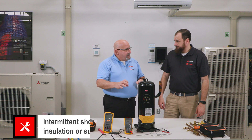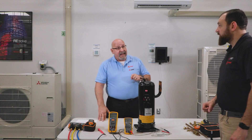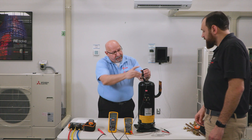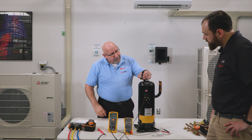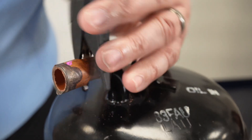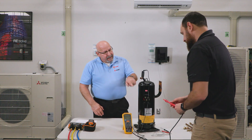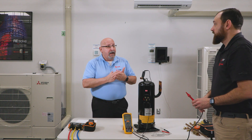So we're going to check the windings now with the Megger. We recommend using the 500-volt scale. You need to clamp the Megger on a clear piece of copper, and since we're using an alligator clip, use the sharp teeth on the copper to remove residue and get bare copper. Set it on the 500-volt scale and go from each terminal. What we're looking for is a value of one Meg or higher — that's the minimum.